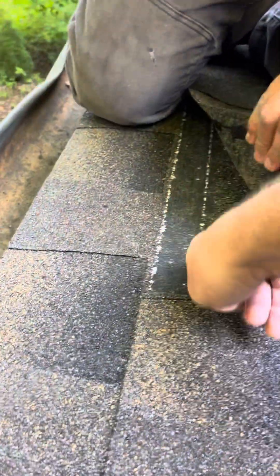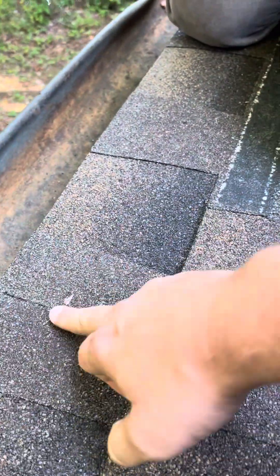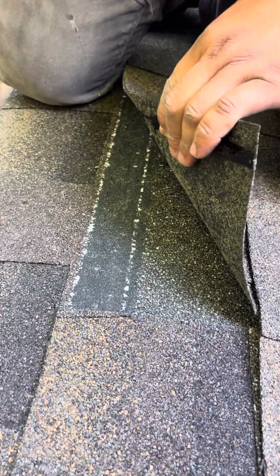Right Juan, are you looking left and right? Did you confirm the other side too? Let's look at it — look at the other side. See, there's no nails here, there's no shingles meeting. There's a shingle meet right here, but there's not one over here, so we don't have anywhere this can leak. We don't need to seal that — that's not necessary. But this side was necessary, right? We went ahead and sealed underneath here, and that will prevent any water from splashing and going left or right.